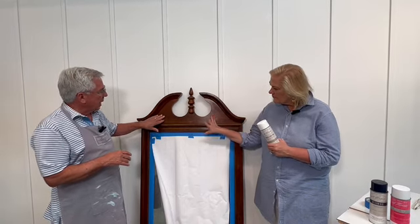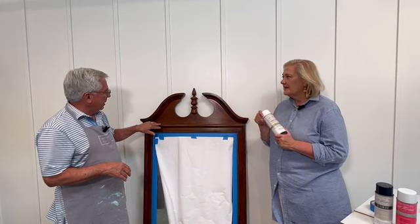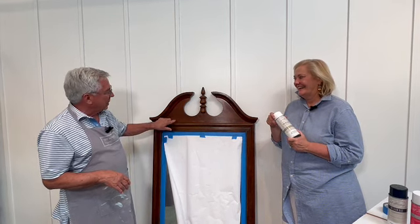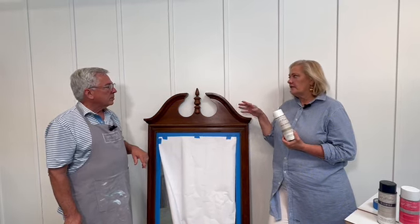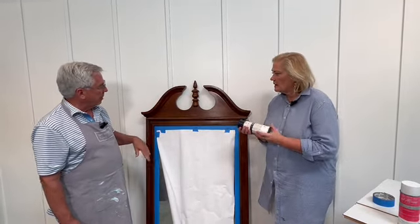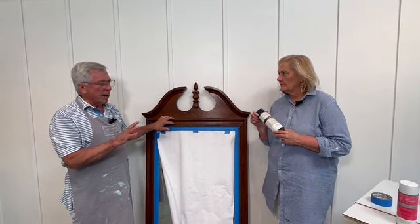In this case, this has been lacquered — it's probably a maple that they used, and then they put a cherry finish on it. I'm always amazed at the obsessive use of fly specking on the furniture from the seventies and eighties. So if somebody has a piece of furniture like this at home, it's not necessary for them to do the primer if there's already a really good, consistent coat or sealant over it. It is smooth, it's not grainy, it's been sealed with the existing top coat. So we're not going to need to use the primer — that'll save you time and a little money. We can just clean it with our clean slate, let that evaporate off, and we'll be ready to go with our lacquer.